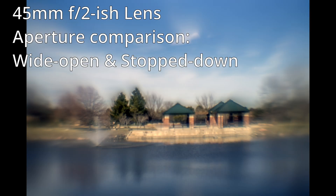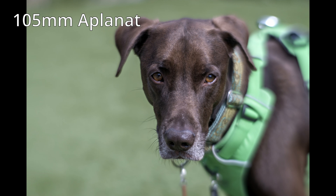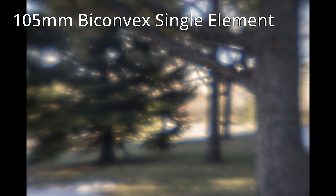Here are the best things I can say to you about this project. It's fun, so embrace it. Go bonkers with the simple lenses because they are just simple and also so enjoyable. Try different lens types and focal lengths, different diameters, and so forth. Put different elements into compound systems. A very simple compound system to start with is two identical lenses pointed at each other — that's a rapid rectilinear. The most complex lens I've made at home is an Applanat out of some simple lenses. Does that Applanat suck? Oh yes, it does, but it's fun to use. Use this project as a learning tool and also as a creativity-building tool. If you have never used a lens that is, from a technical perspective, abjectly awful, you'll likely find that your creative voice benefits from this project. Drop me a line in the comments with questions. Show me the work you do with the lenses you build — I honestly want to see what you can make from this project.